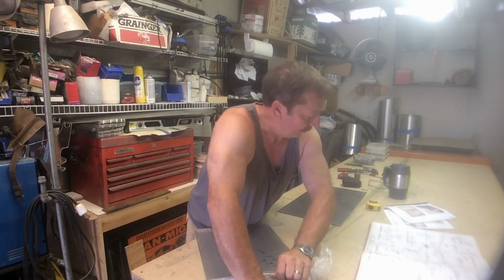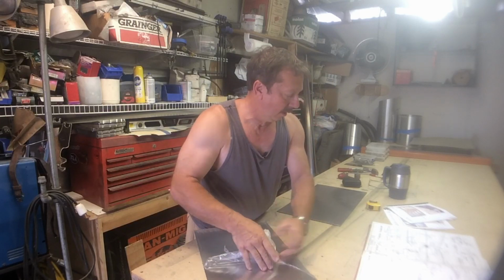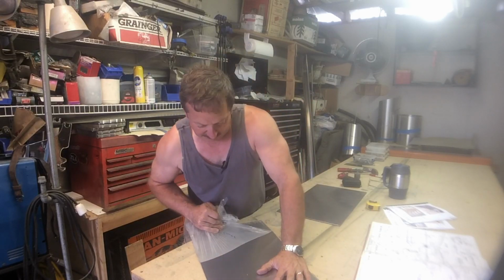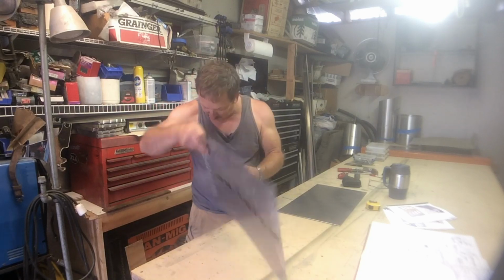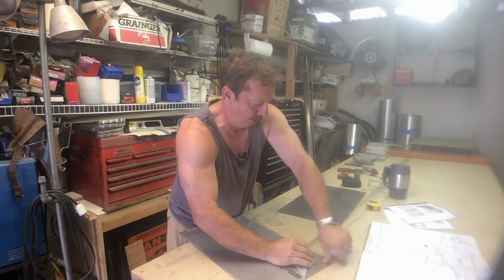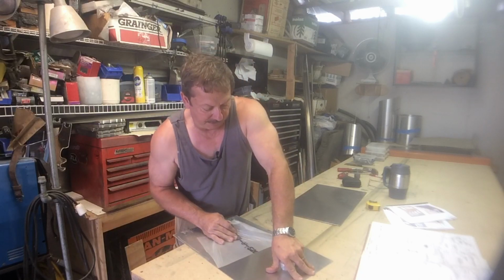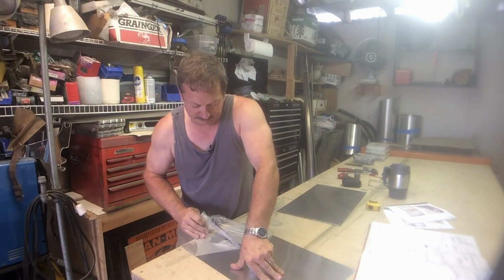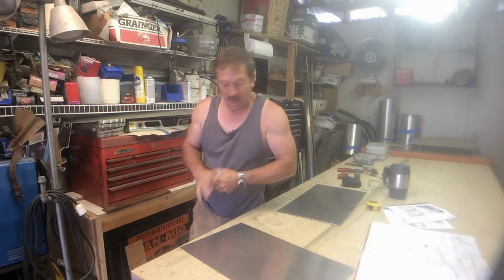These rod covers are 16 thousandths. 550 is overall length, and developed length is 320, but they've got some goofy little angles on them. And I didn't make a template up of these. I think they're going to be pretty close to matching. I checked the dimensions in the back of the fuselage, and it looks like they should line up real well. These fit in, and then top and bottom they've got L angle on the front edge and the side edge of them, and that's what supports them. And it also intersects with part of the structure on the fuselage, so they're well supported.